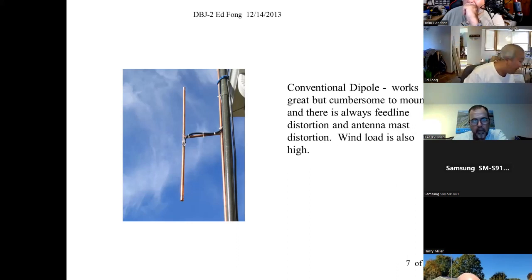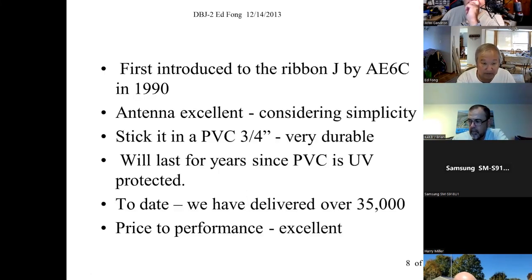And we know this over time. All radials break off, if they're of any significant size. So in this one here, they say you've got to be a good half wavelength out so that this mass doesn't disturb it. By the time you get this half wavelength out, the force right there would be so hard this thing wouldn't last a season. So although electrically that's a great half wave antenna, physically it doesn't implement very well. So that's a problem I've introduced to you.